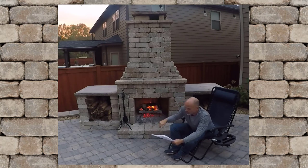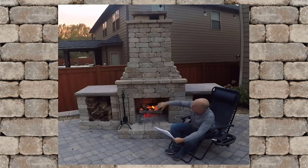The first level of the fireplace has 14 blocks that are totally hidden that you can't see from anywhere. So I was able to use those massively damaged blocks in the first levels of each, the wood box and the fireplace. Kind of segregate the chipped blocks and use them. Be strategic of how you place blocks and save your good blocks for the front.